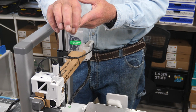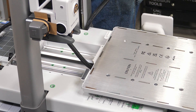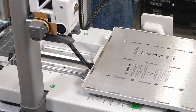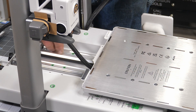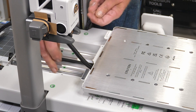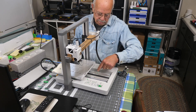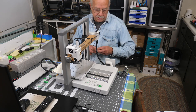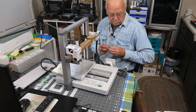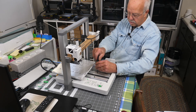Assembly is really simple. Every place you need to put a screw is marked in green, and they give you an Allen wrench — though I prefer using a ball driver, it's a lot quicker. It's just a matter of putting screws in every one of those holes and tightening them down. Then push the heat bed to the other end because there are two more screws there. You'll have one screw left over — most companies send an extra in case one has bad threads or gets lost.